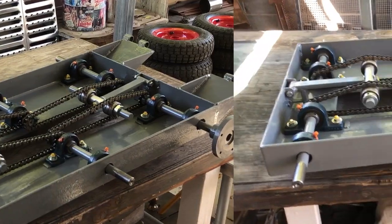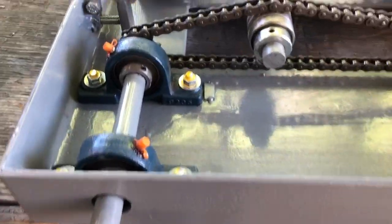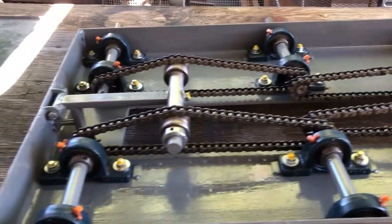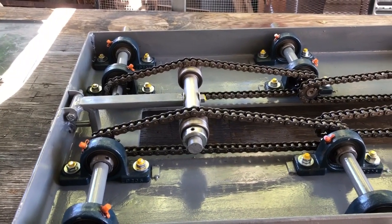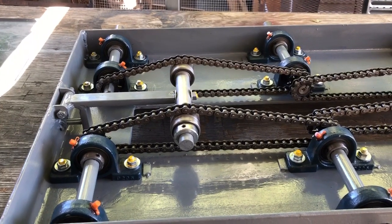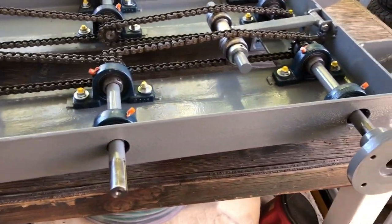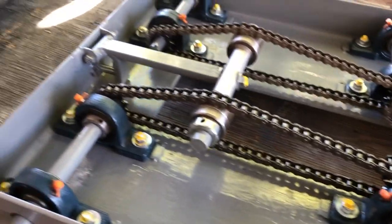Pretty cool, huh? So here's a little walkthrough of these things, give you a good look. There's the tensioner. There's the other one. And you can see yellow paint, that's where I put paint on the nuts. In Arizona, at least in the desert here, in the summer when it's humid, it gets so cool at night and the metal gets cold, and then in the morning it will sweat everywhere, underneath, upside down, sideways, and it'll get to putting surface rust. Well, if you put a little paint that runs around the threads, it keeps that water from wicking into the threads later.